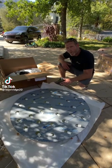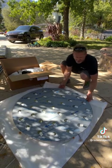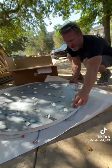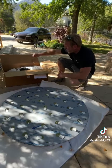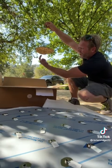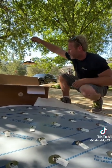This customer wants to hang this $20,000 chandelier on their entry ceiling. The first thing I'm going to do is mount the perimeter support onto the ceiling after taking it off with these nuts. Then I'll mount the canopy to the perimeter after wiring it. There are also these little mushrooms that hang down from each location on the chandelier with an LED light that projects up at the gold — they look kind of cool.